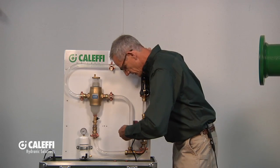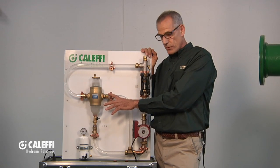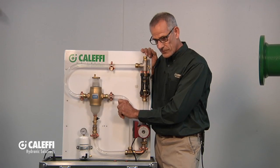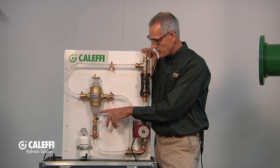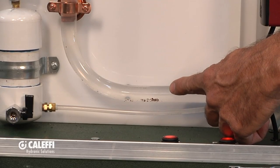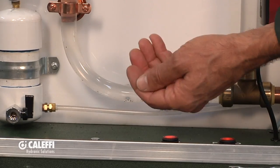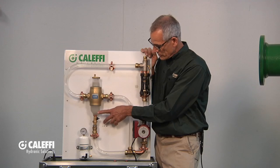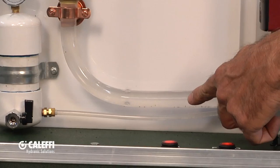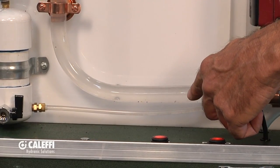One other thing I want to show you — since I've got your attention — remember I told you it also does a good job of dirt removal. So what I did here is I got some dirt. I put some typical dirt that you'd find in a hydronic system — some copper shavings, some real fine sand, some metal shavings. Now by opening this valve here, the dirt laying in the bottom is going to go around in the system. See the dirt moving there? Now that dirt's come up into the separator and you can see it coming around in here.